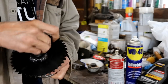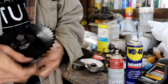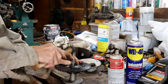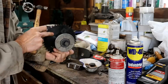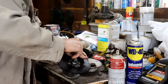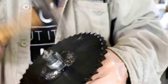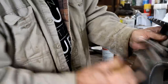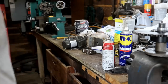I have to get this sprocket on here. I'm not sure if my key's going to fit — I made that hole bigger, so I may have to broach the keyway out a little bigger in the sprocket, or cut the keyway down. It almost goes — I'll try with a little hammer persuasion. I need to get it all the way down on there first before I try the bracket. I filed a little bit of the keyway and it seems to be driving in there, so it seems to be working.